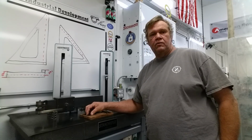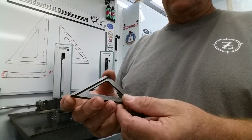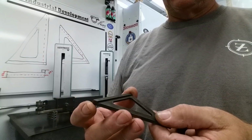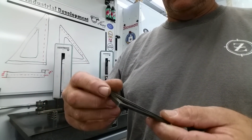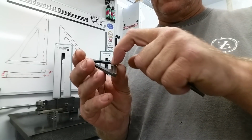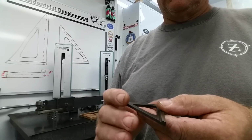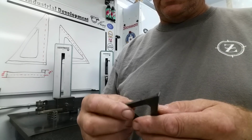Now in part one, what we did was all the flat work, and what you should have completed by now is all the tops of these webs and the tops of these fences right here and on the opposite side. So all just flat work. You've kind of roughed in against your fence right here. You just barely kissed it with a side wheel. You didn't really get in there and clean the side of that fence.